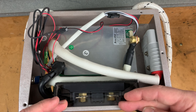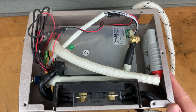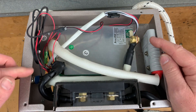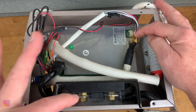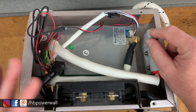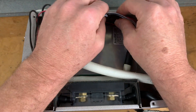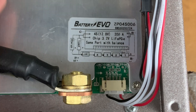On this side we've got a 300 amp fuse accessible via two screws on the side. We've got the BMS down the bottom and the Anderson plug at the back. The positive goes straight down onto the battery and the negative comes up into the terminal, then out the bottom of the BMS, back around to the 300 amp fuse, and into the Anderson connector. The power button on the front is controlled by the BMS, so unplugging it turns the battery on and off. There's also a temperature sensor connected to the battery below.